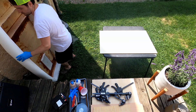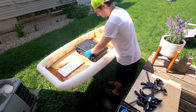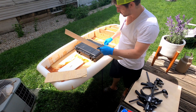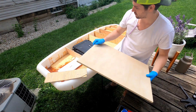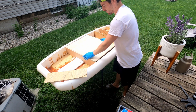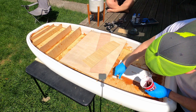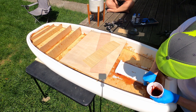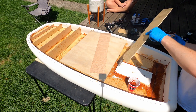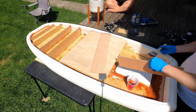Getting into more of the internal structures, starting with the electronics box. This will be an internal box with a half-inch plywood cover that will be removable so we can access it. To give some strength to that motor mount, we're going to add some five millimeter plywood to each side of it and then heavily epoxy those in place. This is just to disperse some of the stress from the motor and also give some support for the rider.